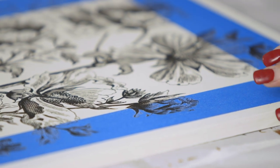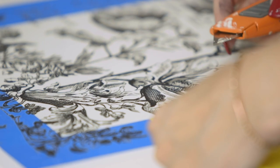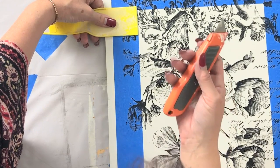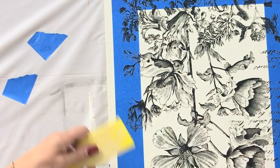You can use a straight edge, like we did for touch-up, to kind of guide it and just do that, so that when you pull tape, it's not putting stress on it and wanting to pull your edge, and you get a nice clean break.